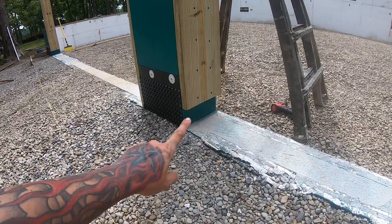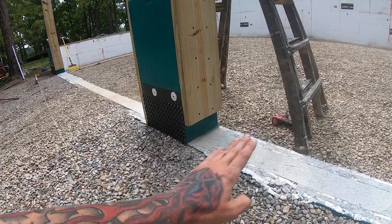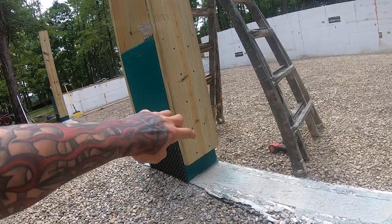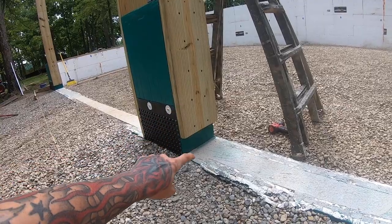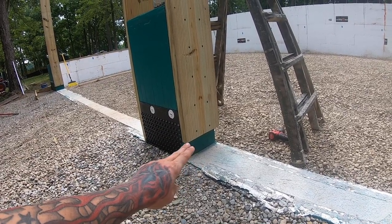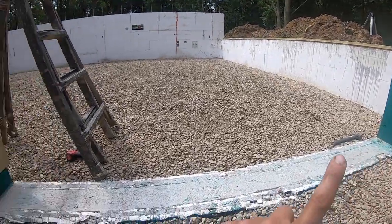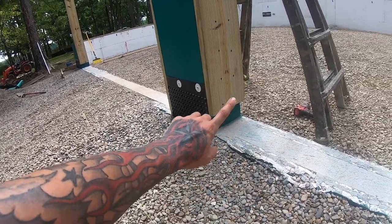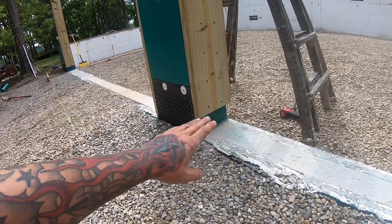One detail: I am cutting off five inches off the bottom of these boards. These are ground-contact treated lumber. When we pour the concrete it will flow under there and this will now act as a king stud - the weight will be supported by the bolts and screws holding it into the concrete, but it will have a concrete base under it to transfer all the load down. I didn't want to put it all the way down to the concrete because it will eventually rot out. The higher we can get it off the ground and away from concrete the better, because this concrete apron in here can always be wet.